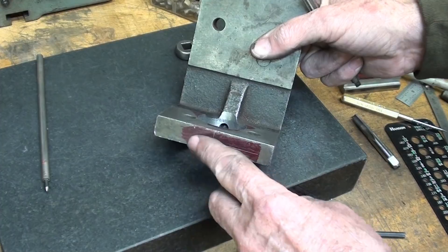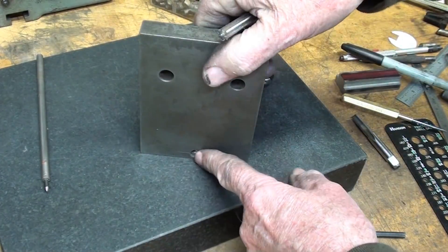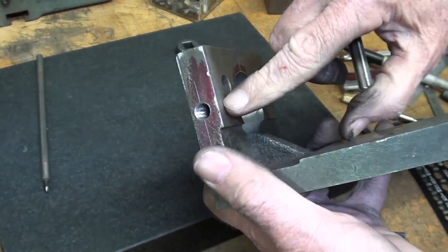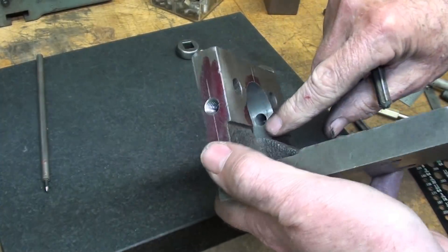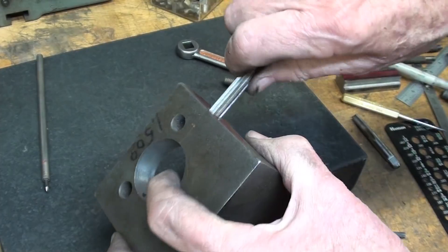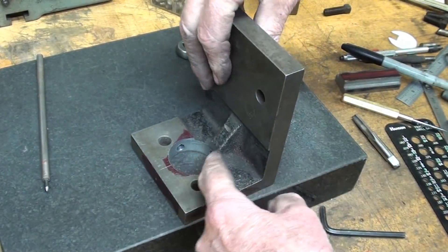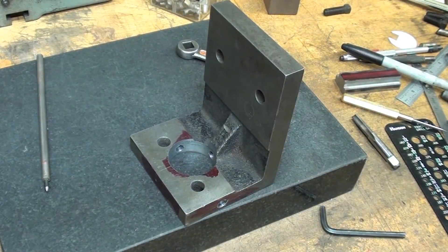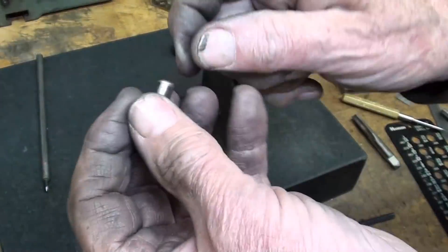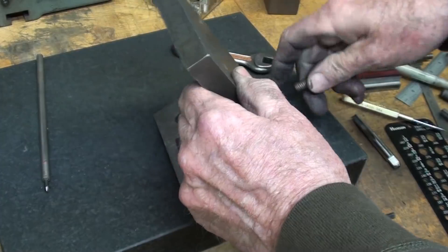I abandoned this one — I can almost go back to it if I need to, but I decided not to drill it. Instead I'm using this one. After I drilled them — let's review: I drilled 5/16ths all the way through and then tapped it halfway. I found it necessary to run a 5/16ths reamer through just to clean it up a little bit. Looking at the one back here, I'm going to insert a pin in there like that — I'll orient it later on.